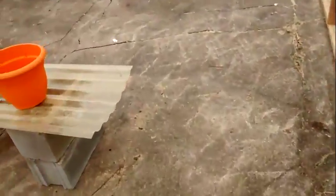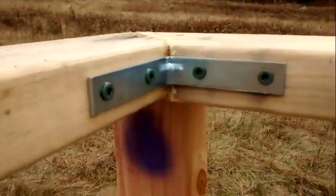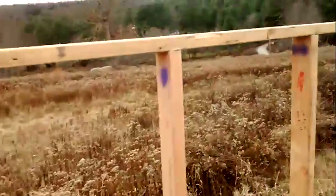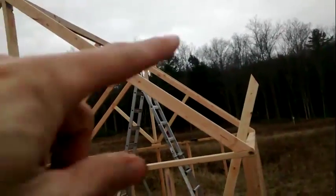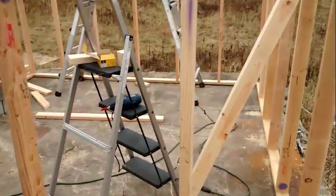I'm going to be working on the roof today — hopefully I can get that done before the rain comes in. I've got the corners reinforced with these brackets, screwed in with 2-inch deck screws, so that will help give some added stiffness. We're going to put the rafters up following the same spacing as the verticals, and then we're going to do a V-shaped truss system. Got some of the rafters up and putting them on the other side now — should be getting pretty close to done soon, at least with the framework.